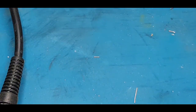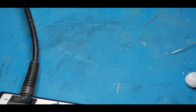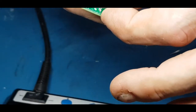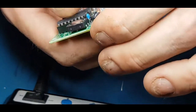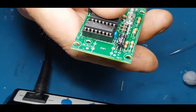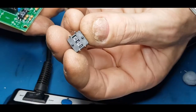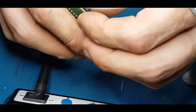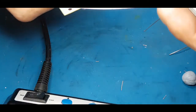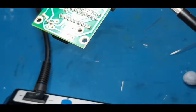So: switch, power, and we are done. The switch is pretty easy and quite simple once you go the right way around — it's literally going to sit in there. What they haven't told you is they've put a couple of pegs on the switch which means it won't sit flat against the board. I'm not sure if it's designed like that but we'll go with it — there's just a little bit of protrusion.